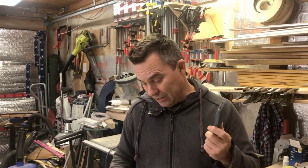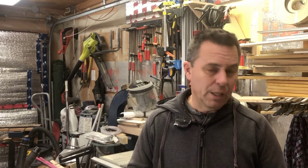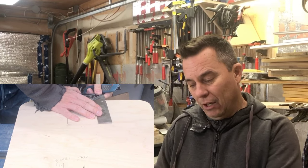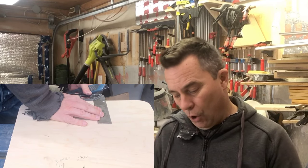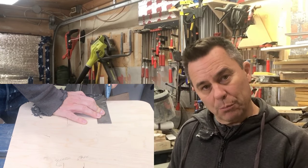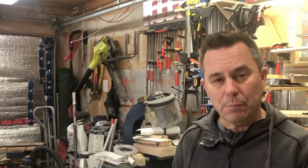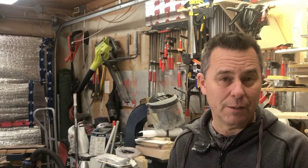Now for my favorite tips and tricks — and this is probably my favorite tip of all. All it takes is a utility knife and a straight edge. If you know you're going to be making a straight cut, whether in plywood or softer solid woods like pine, poplar, or soft maple, take your utility knife and straight edge and score a line — actually cut the top layer of fibers on your workpiece. This relieves the pressure in the wood so that when the blade comes up on the upstroke, it doesn't tear out those fibers nearly as badly as it would without a score line. That's my number one trick.